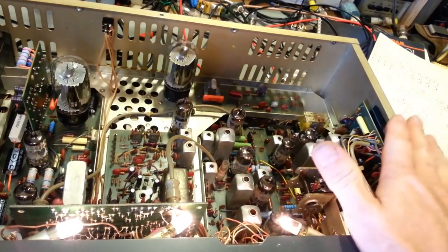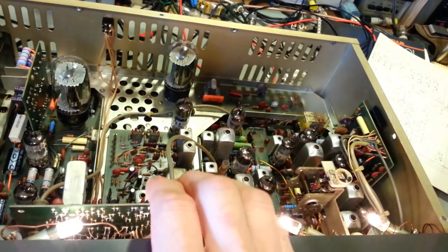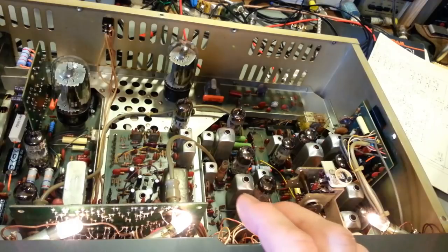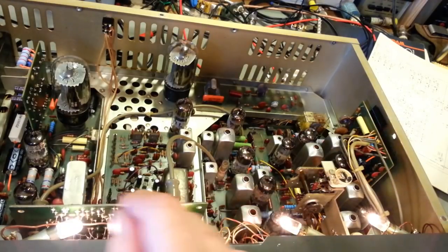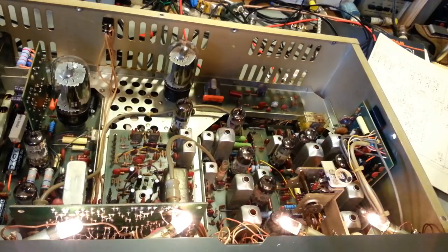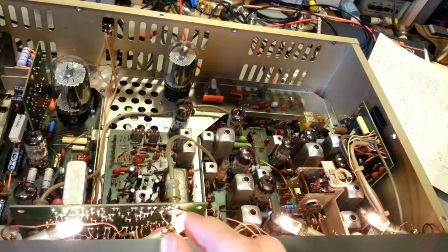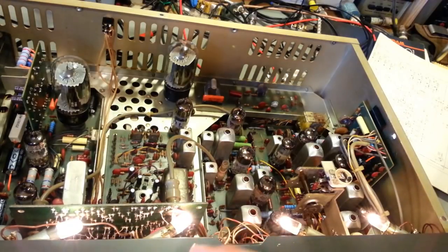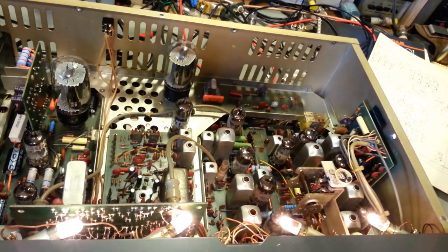In a stock configuration radio, that's a problem because this board controls all of your transmit frequencies. If you want to transmit on those frequencies, whichever crystal might be bad is affecting different channels, and you would need to change that crystal. It would need to be replaced with a new one, or a good used one out of another scrap radio, to bring it within tolerance.